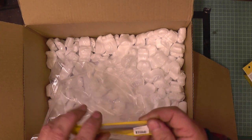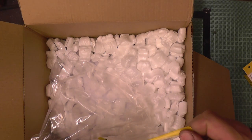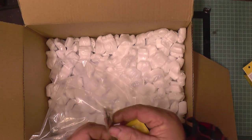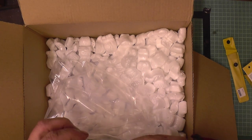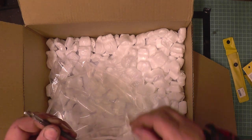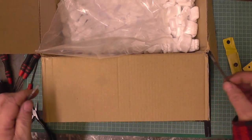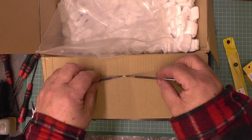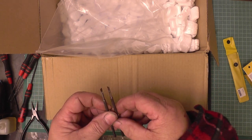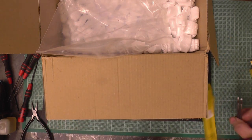What's this? Something in that packet. Get it out. Instead of using my two screwdrivers, I can use these now. The little levers. I'll move the cardboard box over, just there, so it's in sight. And basically, you put them underneath the hand on your dial to lift the hand off. They're like two mini crowbars, but they're not. They're meant for lifting hands. Wow, fantastic!